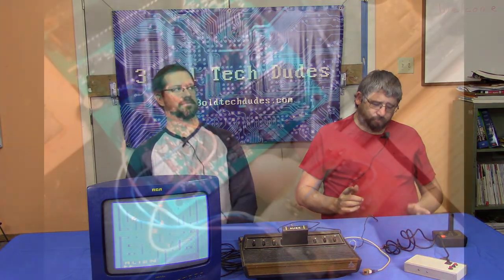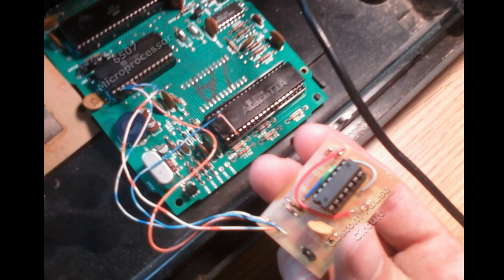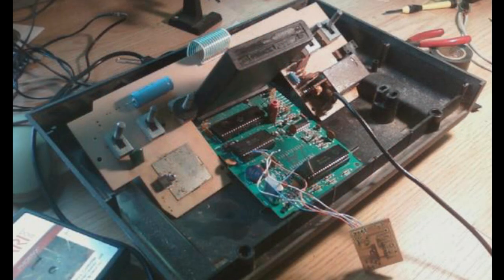There was a pause circuit on the internet that you can add to one of the processors. There's a pin on the processor — I can't remember if it's called hold or pause — it's documented in the original processor specs. The pause circuit works by: if you're at a certain point in the clock cycle, at the peak or the fall, the only time you can actually hold the state is if you engage the hold pin at that point. So we put an AND gate in that monitors the state of the clock, and if you engage the pause button on the remote, the AND gate will wait until the right position of the clock to actually engage the hold. It was a little more complicated than just flipping a pin high.